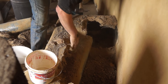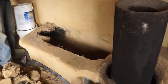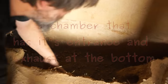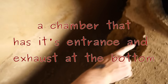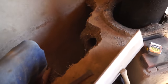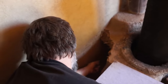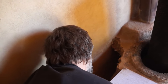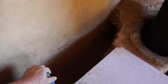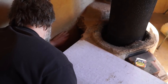We tore it all down, pulled the pipe out. What we have now is an adobe shell - a shell of adobes, and this is the cob wall behind it. We're going to have an inflow from the rocket stove combustion unit and we have an outflow to the chimney. We want to take this hardy backer and we're going to change this entrance now - make this an entrance into the chimney, but it needs to be down low. This entrance into the chimney needs to be at the bottom. So I'm going to use this hardy backer and cob it in up here, put cob over it - so it's a baffle.